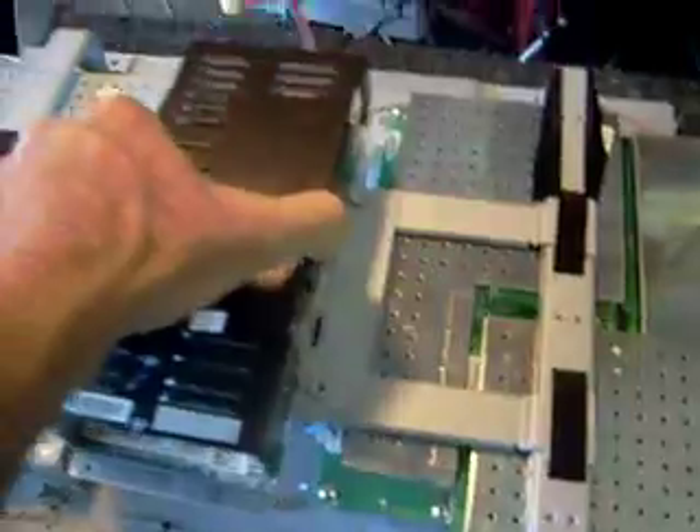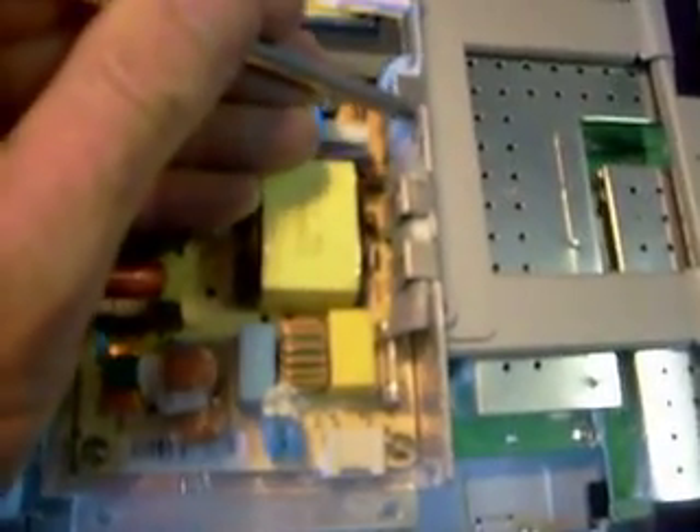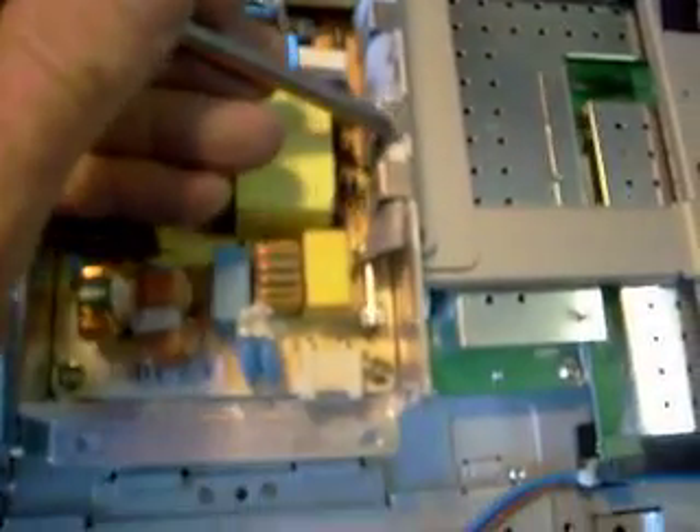I already pulled the screws out of here for the video's sake. I'm going to point at the capacitors and their location to make it easy. This is rather annoying to get all out of here because you've got these clips on the end for the transistors. I put some more heat sink compound on them, and they have almost like a rubberized cloth along the edges, which helps transfer the heat from the transistor.